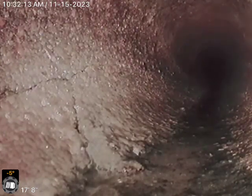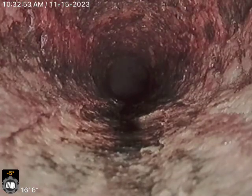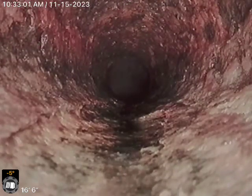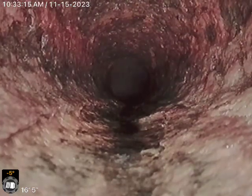That way, you don't have to worry about any cracks or root penetration in the future. What's the distance of pipe covered by that epoxy liner? We would do a 10-foot partial repair on your property, and grab a measurement of how much pipe is left after the repair to your city connection, and we would line that amount — all the way from inside of this crack all the way out to the city line. That's the highly recommended route, because you're not going to have to worry about the issue in the future. If you want, you can just do the partial repair right there at the crack, and then have Jose do maintenance on the system in the future.